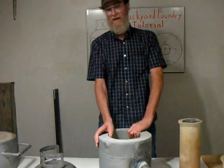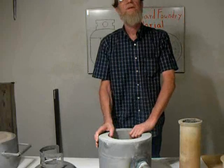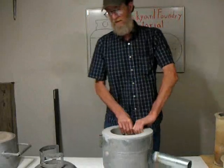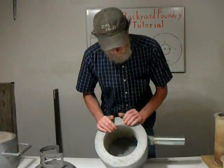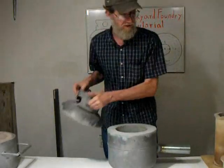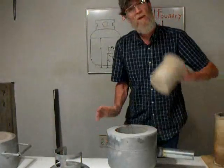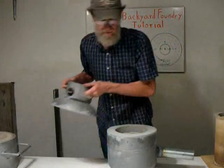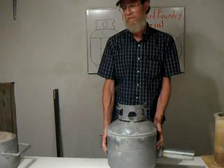Here's what we've got so far. We've got all the metal fabricated, the refractory cement in along with the backing of a ceramic blanket, and the edges turned out pretty well. There's a little bit of residue from cardboard which will burn off — no problem. We have a base on it and the lid, which also turned out pretty well. It can be used in this manner — just put the burner in there and a small crucible that fits down inside. But this is not really what we want. It's not quite as efficient and needs to be a little taller to take advantage of all the heat it produces.